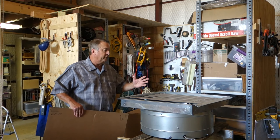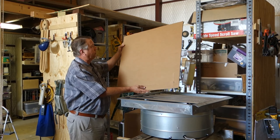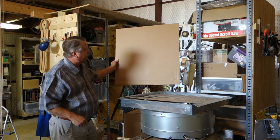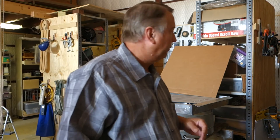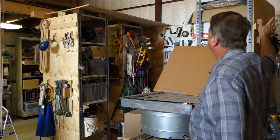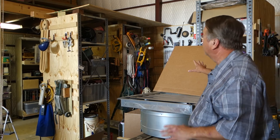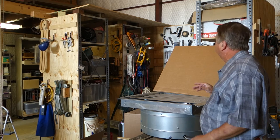As a helpful aid to be sure I'm making the cutout in the right place, I got a piece of cardboard and cut it out to be exactly the same as the rough opening — so this is 28 and a quarter by 28 and a quarter — so I'll be able to hold it up against the wall inside my shop to figure out exactly where I want the cutout to be. My building here uses R-panel siding. On the inside, when I bought the building it was already insulated — it's got about a one-inch thick foam-looking insulation with chicken wire holding it up — so one of the first things I've got to do, once I figure out exactly where I'm going to do the cutout, is cut the chicken wire and cut the insulation so I can even get to the metal part of the building.